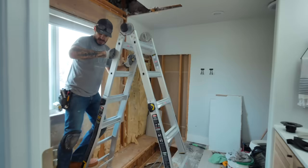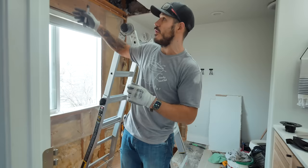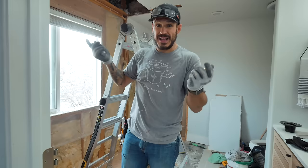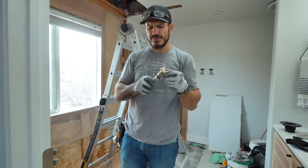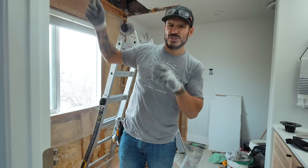We're doing the water feature coming down the middle — the waterfall — and the 45-degree shower head as well. The PEX piping is going to come running across the attic and into a drop ear, which secures right into the studs. The PEX piping slides in here and this is where the shower head will come in. We'll cap it all off for now, and we'll have two PEX pipings total.